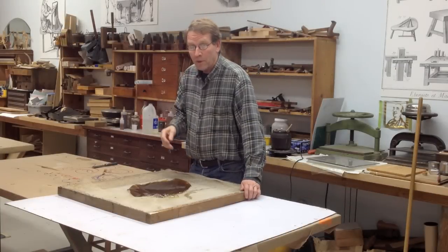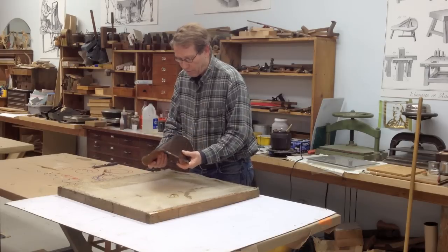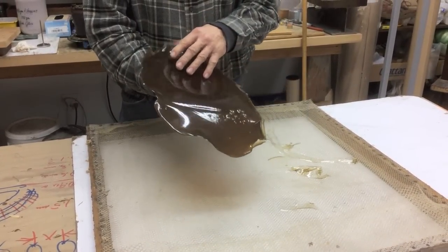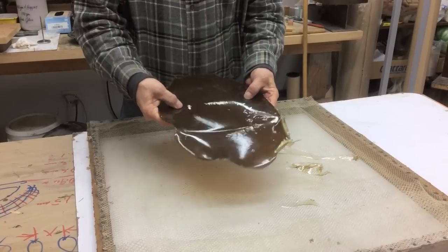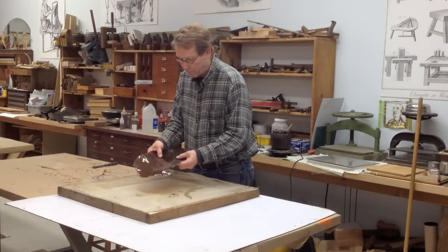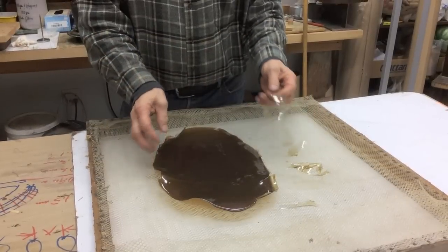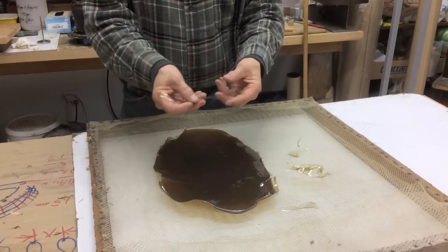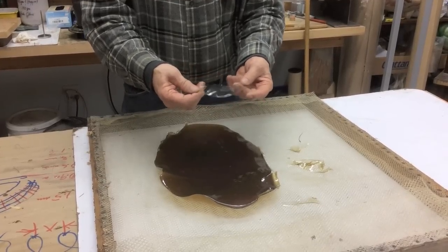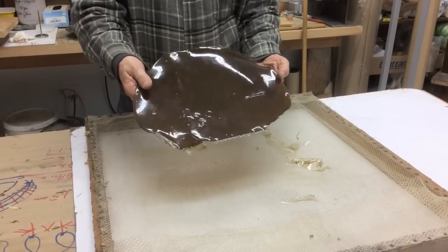It's been 48 hours — let's take a look at what we have. We have a sheet of glue which is still very flexible because it takes a long time to cure and dry. That's typical of protein glues in general because the moisture has to evaporate, and it takes a long time when a film forms over the surface. This thinner layer here is already fully dry — it's a protein glue that has lost its moisture and is now a film. It could be hydrated and cooked and used again, but the thicker glue may take a week to dry completely.